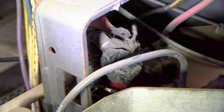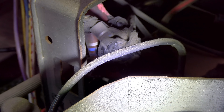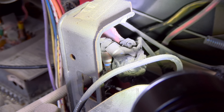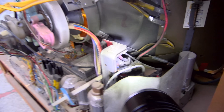One of my main reasons for digging this out was to cover this focus board, and this is not exactly what I remember. What I remember is clean notches cut in it. It looks like here somebody just globbed silicone all over. They cut the board out because it had become conductive and was arcing, then just left the parts free-hanging and blobbed silicone all over. You can see there's a couple of 20-meg resistors just covered with silicone.